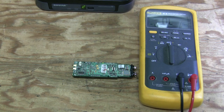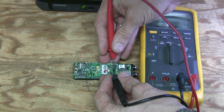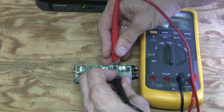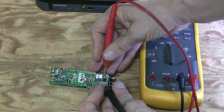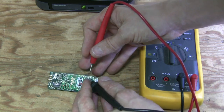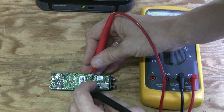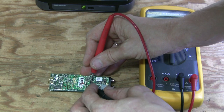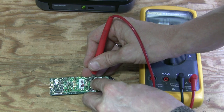Look what I found — I'm doing a continuity check on this button. Not very convenient with just two hands, but it seems like the button has failed. I'm pressing it and nothing happens. There is another identical button here for changing channels, and when I probe that one it works just fine. But this power button doesn't. When I managed to power it up those couple of times, maybe I pressed it harder or it just partially failed inside. I try pressing it a little harder — and nothing happens.